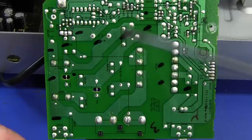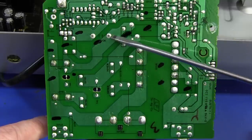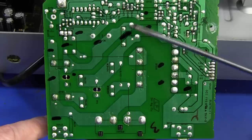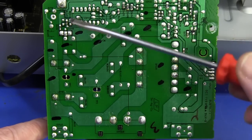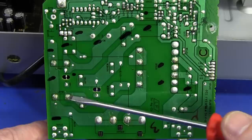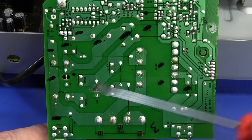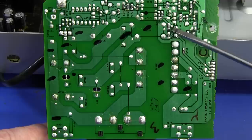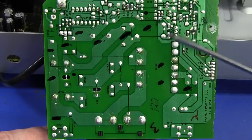So here's what we've got: the mains input connector going down to this relay - you can see they're labelled on the back. Here are the two relay contacts and the relay coil. When the contact switches it goes through to the fuse, which has nothing to do with the standby power circuitry - it only protects the transformer. This is the connector going off to the transformer. The relay is switched from this board-to-board interconnect down here - just a pin which goes up and switches that relay on.